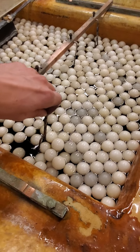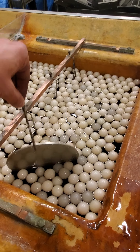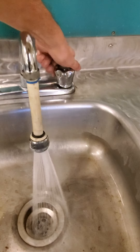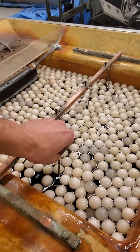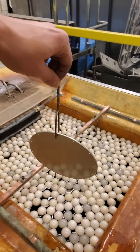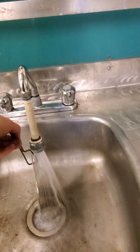I'm going to take these out one at a time and rinse them off in cold water. Before I take them out I'll get the cold water running — it has to be cold water. If you use hot water the anodizing dye will not go into the aluminum material properly.